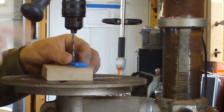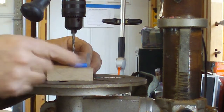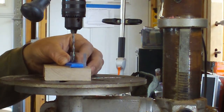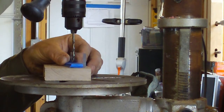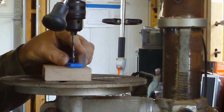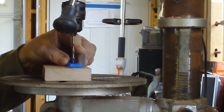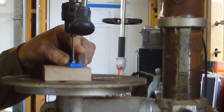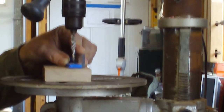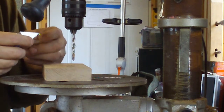I don't want a bubble. You may have seen reservoir designs with a flow diverter that has no hole in the top — a bubble will just get trapped and rotate around, which is very annoying. It can trap air when you're filling. So I'm taking my acrylic piece — the little part I've just about finished — and making a nice hole in the center of that channel.